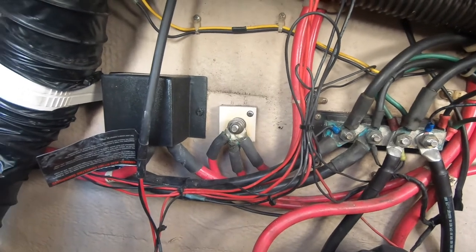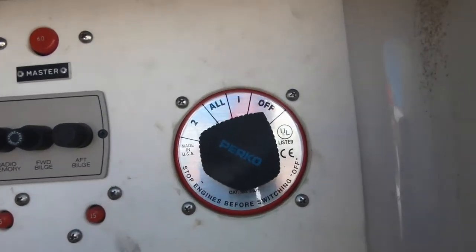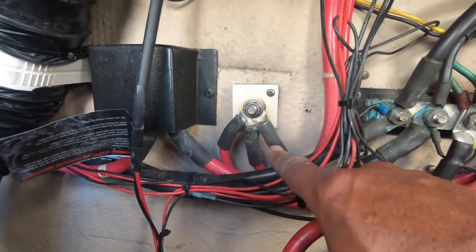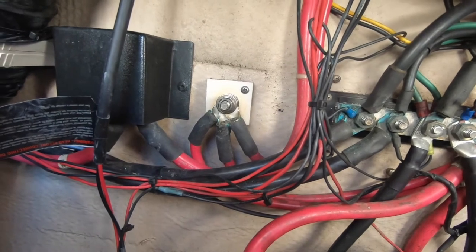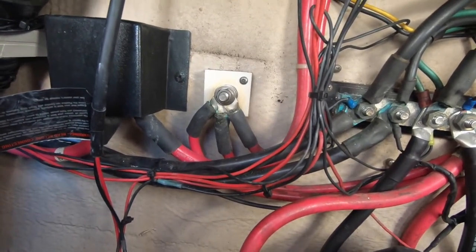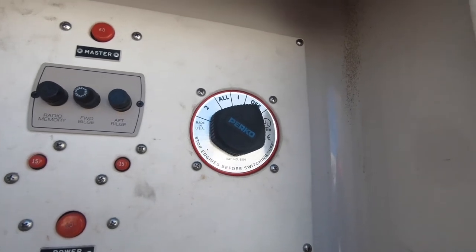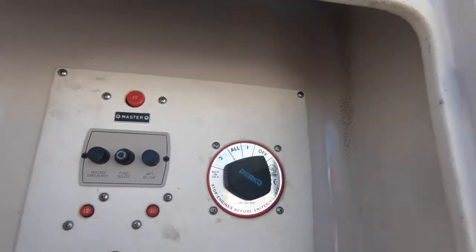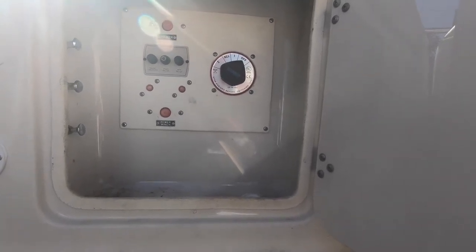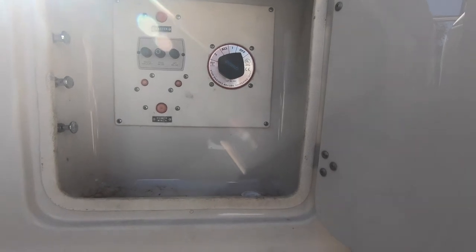Okay, Big Al again — we're back to do the electrical portion. The way I'm wiring mine, I want this winch to be off whenever I shut my master power off. To do that, I found my terminal block — this is the line that runs power to that master all-switch. The two batteries come up to there directly, and once you turn it off it doesn't allow power through here anymore. I'm connecting the winch to this terminal block so that when the master switch is on — positions one, two, or all — I can power my winch. When it's off, everything shuts off. That way if I shut the boat off at night, I know the winch is off.